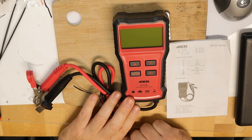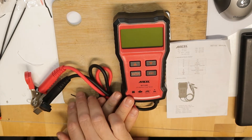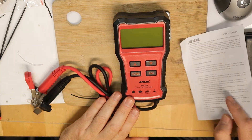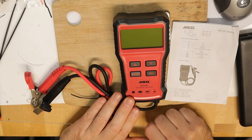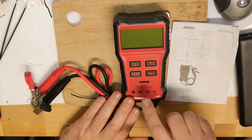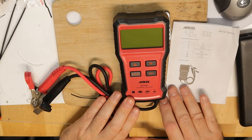The big question is how this tiny device works. Because the older devices, if you're familiar with them, are very big and have a heating element — you're actually putting a load via a heating element to test under very high current. In these newer devices it's much more simple: you just apply the battery type and set the discharge current.